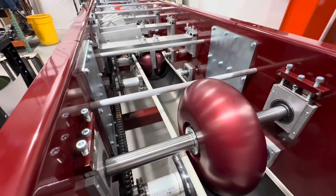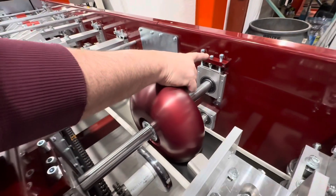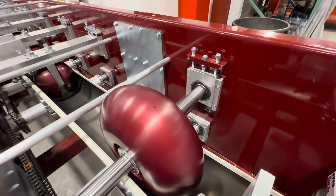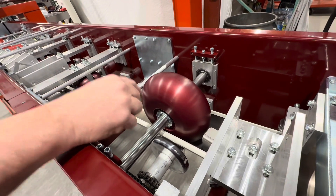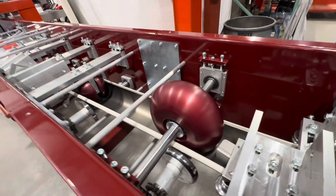If you want to make the gutter close up better or deeper, you go down with this station. Loosen this bolt, loosen that one, then tighten these bolts and tighten that one to create pressure — maybe a quarter to a half turn. You don't have to do a lot, and you don't want to go down too far.